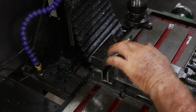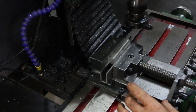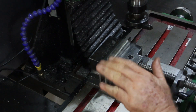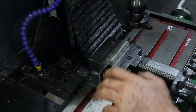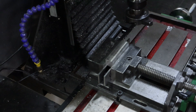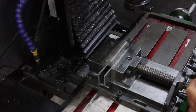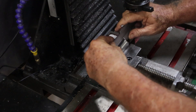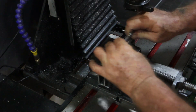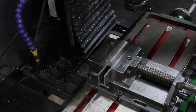I'll definitely have to do something about that terrible finish when I extend these slots so I can bolt this thing down front and back - the weird finish is almost suggesting it's rocking and it's only bolted in the center. Anyway, I remembered I had a piece of three-quarter square up on my rack, so I decided I couldn't be bothered cutting up that other piece and I'm just going to make the clamps out of this. Got to take 10 millimeters out of it.